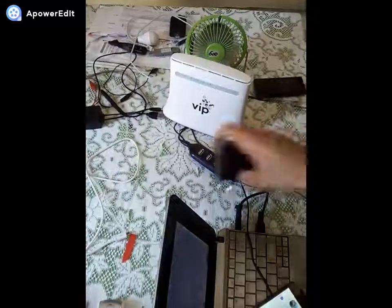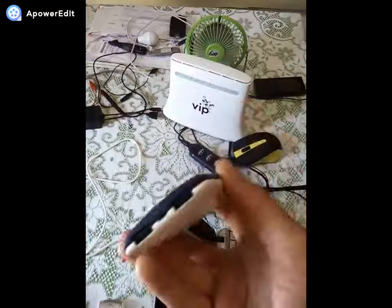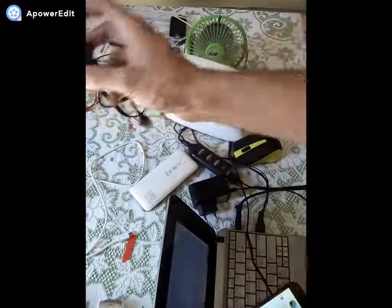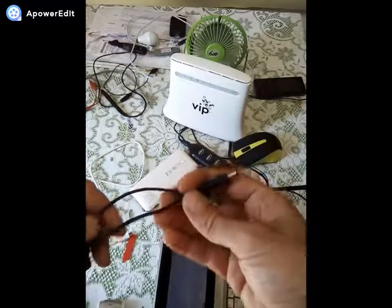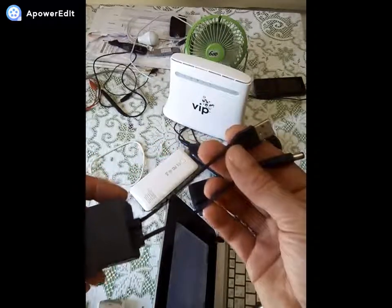What do we have here? We have this power bank of 7000mAh with two outputs, but it only has 5V, and we need 12V with strong amperage. To bridge that, I made this device — it's a converter from 5V to 13.5V, meaning it can charge a battery and cover everything that runs on 12V, and it will be powered from this power bank.